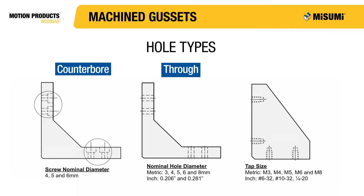The through hole option allows the fastener to enter from either the top or the bottom of the gusset. The tapped gusset allows for more threads to be engaged than a counterbore or through hole type gusset would when fastened with a nut or bolt. This increase in threads engaged results in a greater holding force. One reason you need this increased holding force is because tapped type gussets have a different profile which can handle a larger load. By increasing the thickness and length of the diagonal section of the gusset, you are able to distribute the load over a greater area, which results in the tapped gusset having a greater max load.